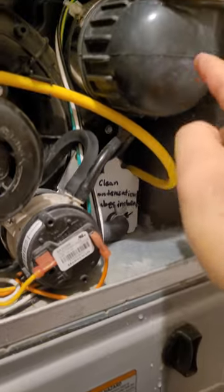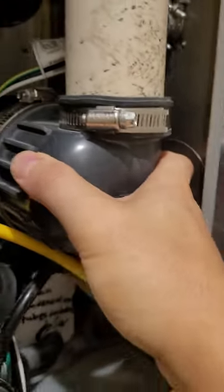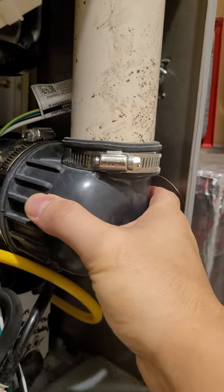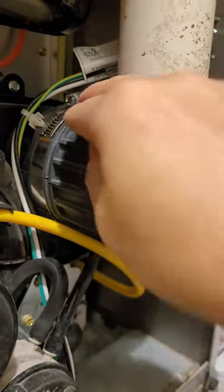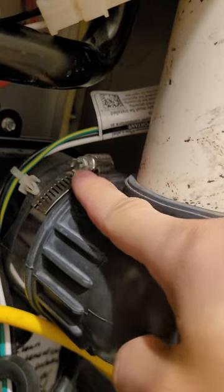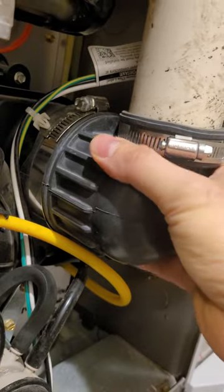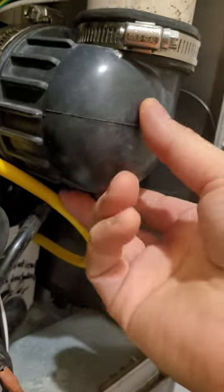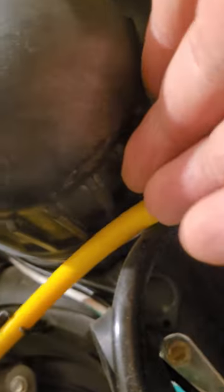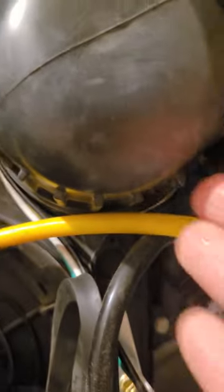There's another chamber here. This chamber was full of water after a lot of rain the past couple of weeks. I guess the air getting pulled in to the heater from outside of the house had a lot of moisture. So I had to unbuckle this belt and get this off, pull this out — it pulls out fine, you're not going to break it. Wipe out the water in there. I actually just had a knife and put a cross incision here — I put a little hole in there.